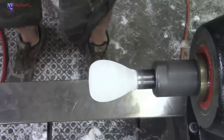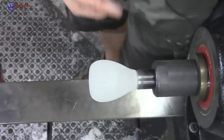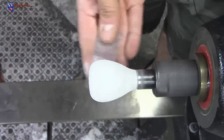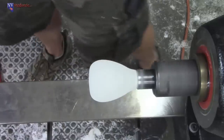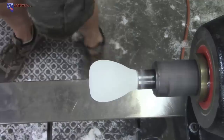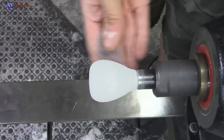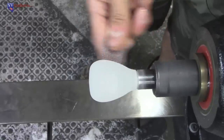Now, one thing you can do to get around having to wait 7 days and then polish the resin, you could put a CA finish on top, and then you can avoid having to wait. There could be some drawbacks to that, maybe, but I probably wouldn't recommend doing that the first day after. The only issue I have is if the resin shrinks a little bit, that hard coat on the outside might crack. But it is one way to get around having to wait.